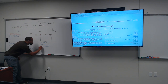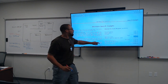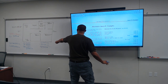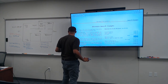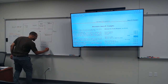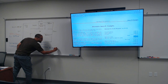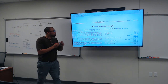So 7,740 minus 3,000 is 4,740 VA. Now we have 4,740, this value right here. We're gonna multiply that number now. 4,740 times 35% is 1,659. Okay, thank you. So 35% is 1,659 VA. All right. Now, according to our example here.